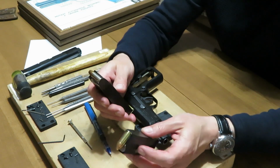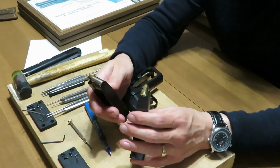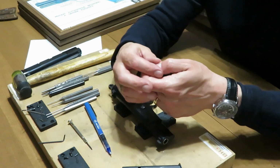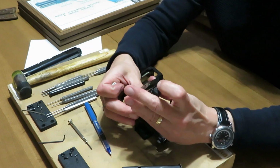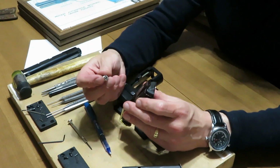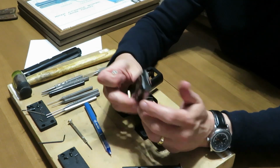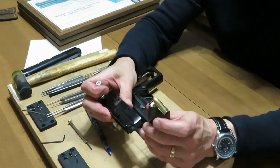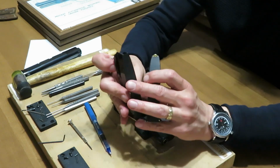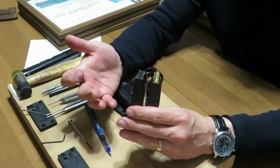And for today's older high powers, we just consider the old magazines a necessary replacement item for a modern magazine. The modern magazines do have a plastic follower. In my opinion, it's just a smoother extraction of the round. When the slide comes forward and strips that round out of the magazine, it's a smoother action than a metal on metal relationship. It's a better idea. Not exposing the primer is a better idea. Keeping the metal level across the back of the magazine to support the feed lips is a better idea.